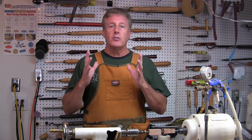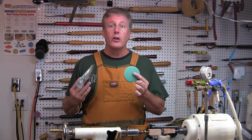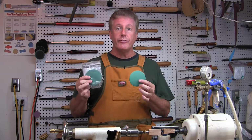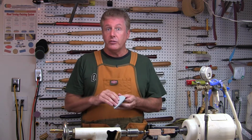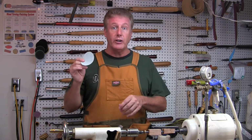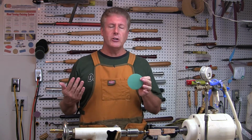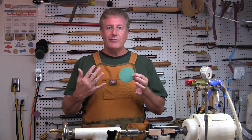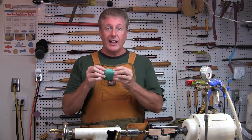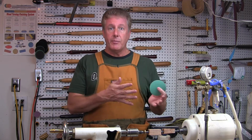Thought we would spend some time and talk a little bit about Greenflex discs and what you can look forward to. Greenflex are a mylar film back disc. They're very durable. They're very similar to the Blueflex in that they do have the mylar film. What does that mean? Well, that means that you can't tear them. Think of the mylar film like thin x-ray paper. The abrasive is attached to the thin x-ray paper. Makes it very durable, long-lasting, because the backing doesn't tear. As the disc wears, the backing doesn't tear.